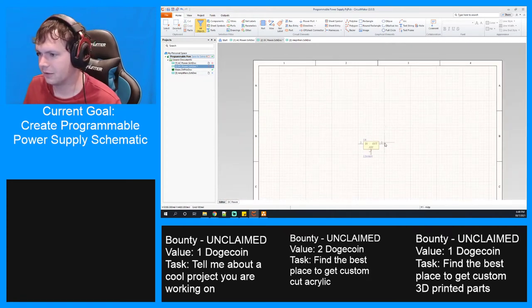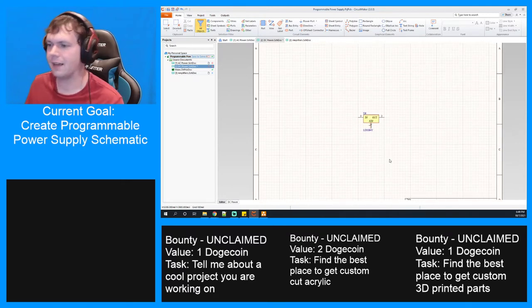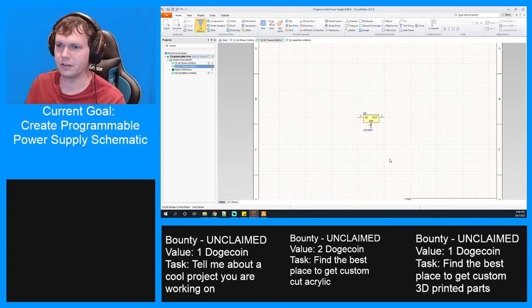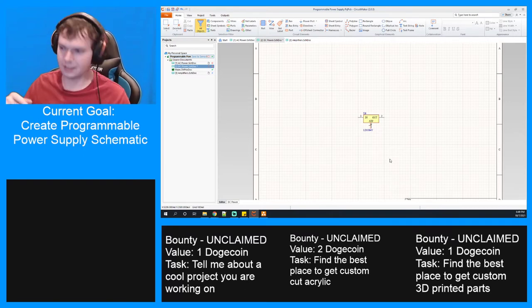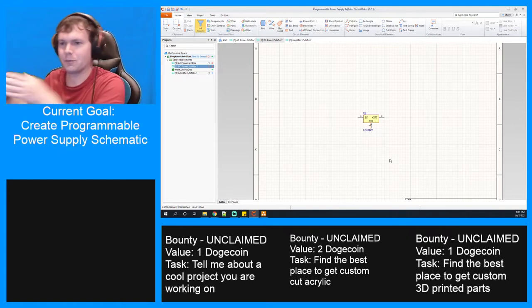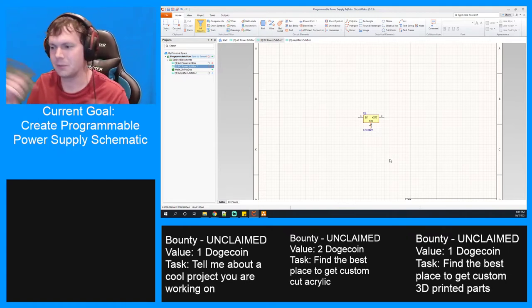One thing I've noticed is that there's a clicking sound every so often. When you get up above like 5 or 6 volts, there's a click of a switch or a relay or something turning on or off, and it'll happen again later. So even though they give you a continuous range of like 30 volts, they're actually separating it into sections and running it with different components and then just switching between them. Each one is adjustable a little bit.